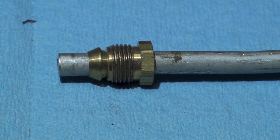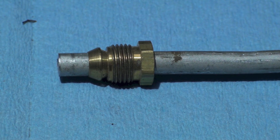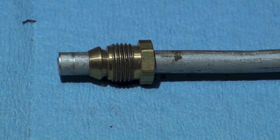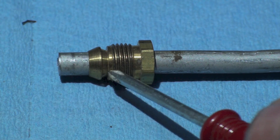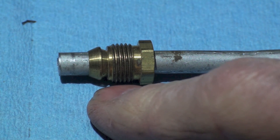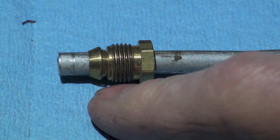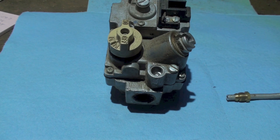See, when my tubing's in like that, the ferrule actually crimps down on the tubing. This one's designed so that as I tighten this, it starts to crimp right here onto the tubing, and as it crimps it actually breaks off right there — it's a real thin thickness there, it just breaks off. Then you finish tightening it up. This is pretty much exclusively used with natural gas on pilot tubes.